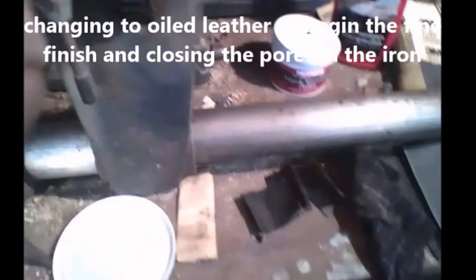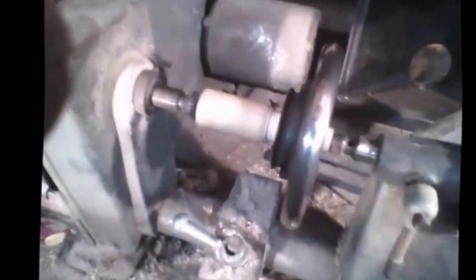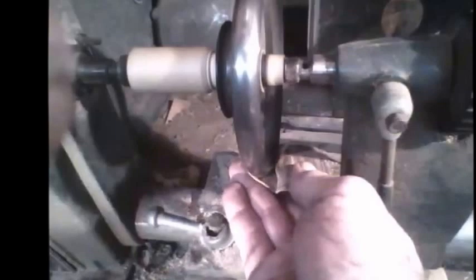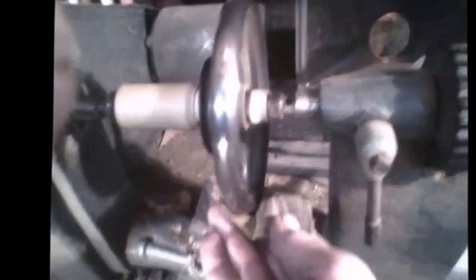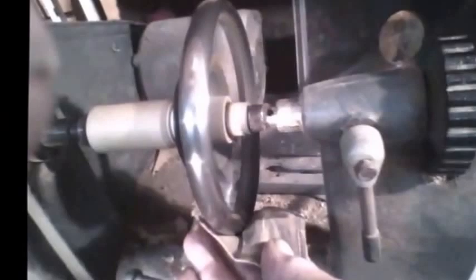What I'm going to do now is something I didn't mention in the first video. This is a piece of suede shoe leather — this would have been an old trick from back in the day. I'm going to wipe up some oil and put pressure on it with the shoe leather to generate some heat. When the leather gets hot, I know I've generated enough heat to start rolling the pores of that metal over. It's starting to warm up — let me get a little more oil.